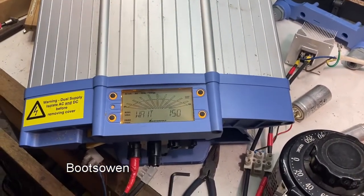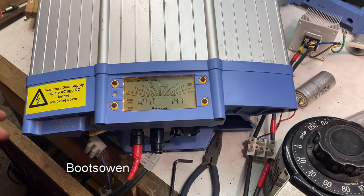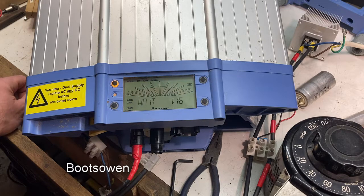The Mastervolt has two inputs and a DC switch, so it's kind of useful if it would work — 3.3 kilowatt with a 100 volt start. In theory you could get this going off three or four panels. Four panels would be a neat little machine to have on the roof of a shed. Probably not as efficient running at partial load, but it'll probably never die running under capacity.